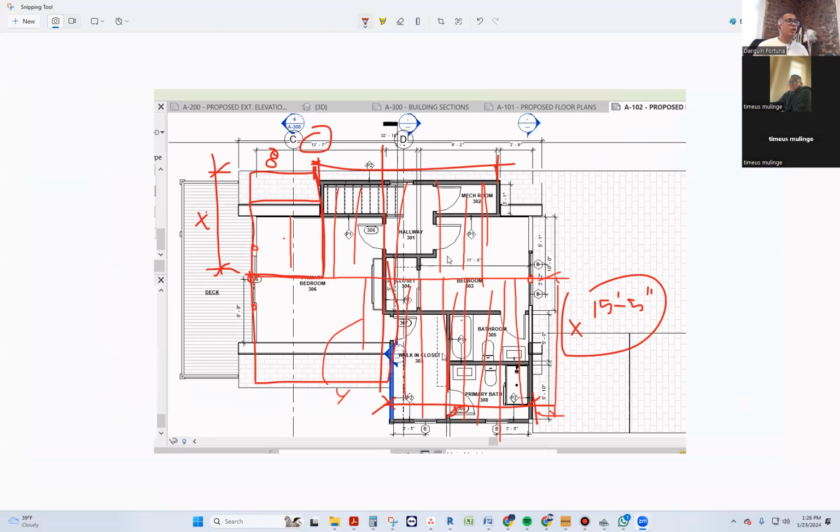There are other things you may want to be aware of, but they're negligible. And that is the fact that this wall has load and you're gonna have a beam below. So just size a wall onto that beam. Have you ever sized a wall onto a beam? Yeah. Just think of it as a square, but I know it's triangular, so it's gonna have more load than what it really needs to be. Because below these point loads right here, you're also gonna have a beam that's gonna support it, and actually it doesn't go to the outside, you're gonna have it somewhere here because this wall continues below, right? And then you're gonna sit it on the outside wall, right?